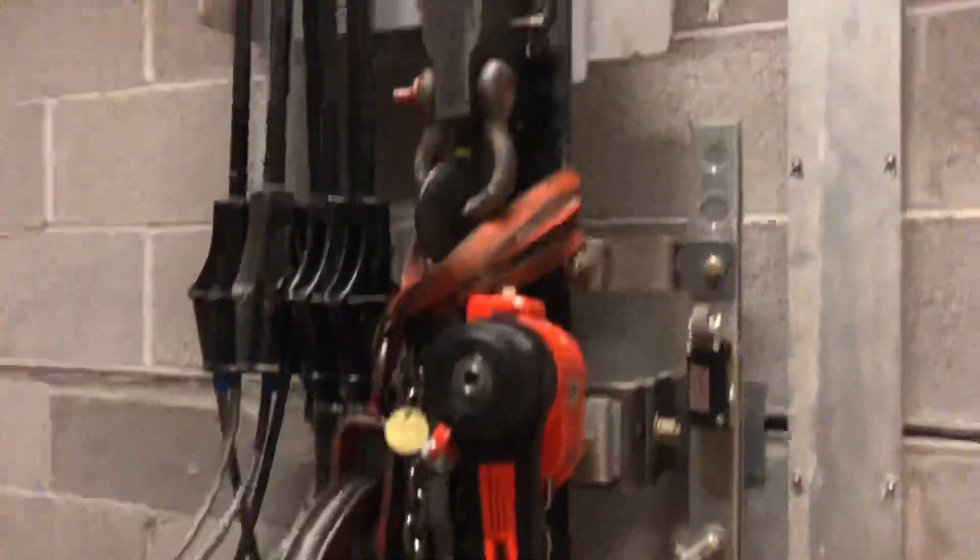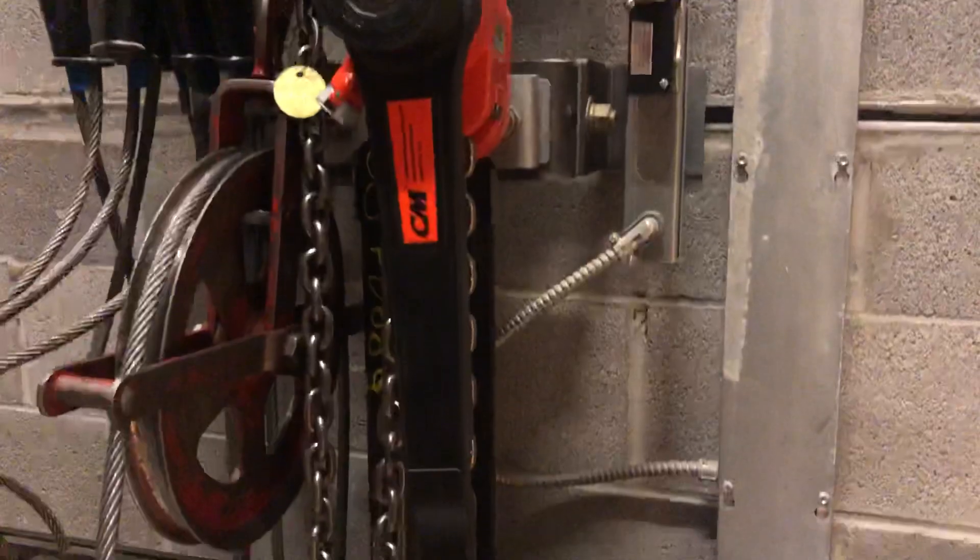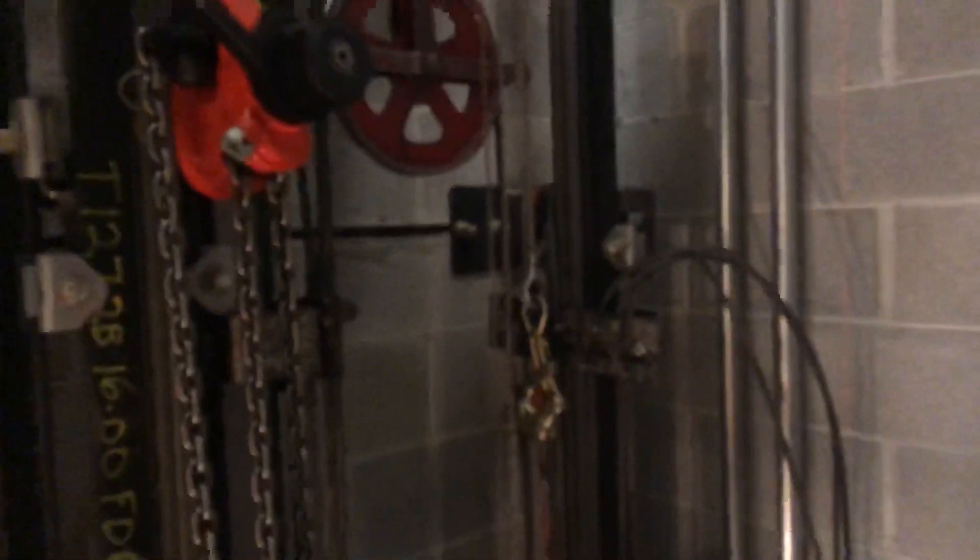We're here in the middle of a rope job. This is the car top right here — you can see we have the car hanging off of some rail dogs. On the other side there's another one, and we've got a three-ton hoist holding the car up. Over here is the safety mechanism — I have a strap holding the safeties up, so we have three means of holding this car up.